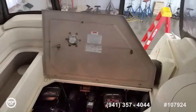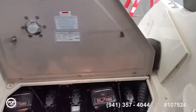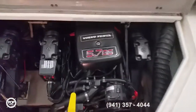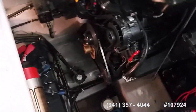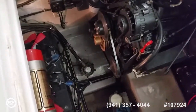Looking at the back of the boat, the engine hatch is up — it's a manual lift and the two struts have been removed for easier access. You can see the twin 5.7-liter Volvo Penta GS engines on 350 Chevy blocks. The trim tab pumps are down in the back, and there is one bilge pump there and one down in the back. On the starboard side you can see a seacock and a strainer for the air conditioning system.